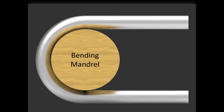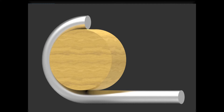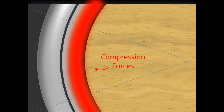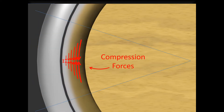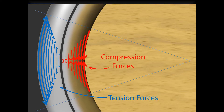The situation is the same with a stainless steel wire wrapped around a bending mandrel. Rotating slightly, we see the wire cross section. At the widest part of the wire, we can highlight a center plane in black around which the wire tends to deform. Zooming in on this smaller section, we see the inside portion of the wire is under compression forces that try to squish it slightly, while the outside portion is under tension forces that try to stretch it. That level of compression — squishing — increases toward the inside, while the level of tension — stretching — increases towards the outside. Even though stainless steel is quite strong, if you stretch it enough, it will fracture and break. This is a stress fracture, and that is exactly what we very much want to avoid.